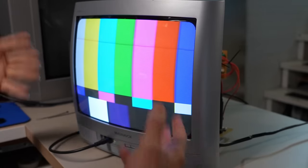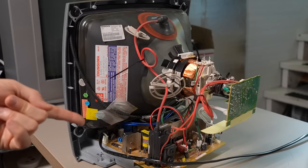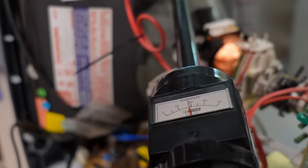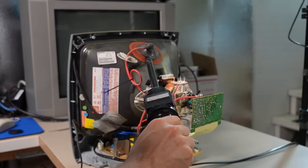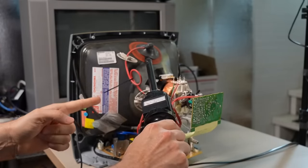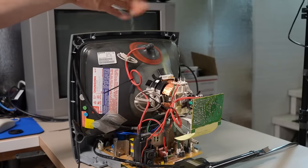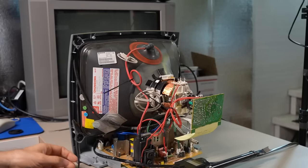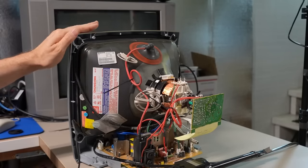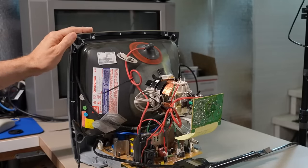If this does work, that new board won't fit inside this case as-is — the front inputs are part of the PCB itself. It will require some kind of custom case. Let me power this off and take it apart to look at similarities. One thing to check first: the operating voltage of the CRT — it's around 20,000 volts. Working inside a CRT is very dangerous — open power supplies are dangerous, and 20,000 volts plus mains voltage potential up to 240 volts is extremely hazardous. Only work inside a CRT if you know how to be safe.